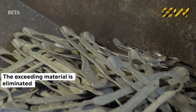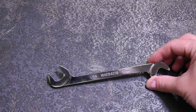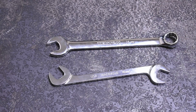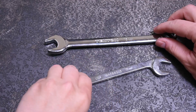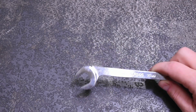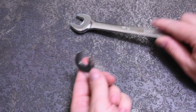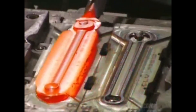We've talked a lot about the differences in these two ways of making a wrench because it's just interesting, but does that make this particular tool bad? I think no way. This tool is designed and specifically tailored for awkward-to-access fittings — it's the only reason you'd reach for an odd offset double open-end wrench to begin with, so we're not talking monstrous amounts of torque here. In my opinion, Tekton picked the perfect tool to try this process on — and just look at it, it's a good-looking tool. It's very unlikely you'll run into any scenario where the shortcomings between these two wrench types would materialize in real life. But it does perhaps explain why there aren't small tool houses churning out large everyday hand tools this way, because whether it's pistons and crankshafts or combination wrenches, forging will always be king. Thanks for watching.